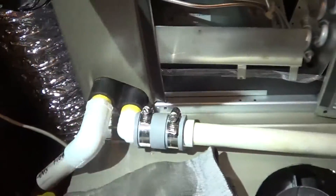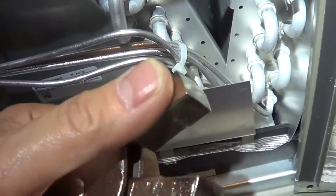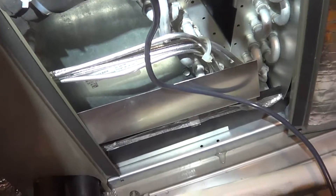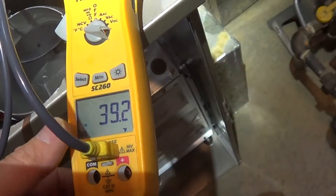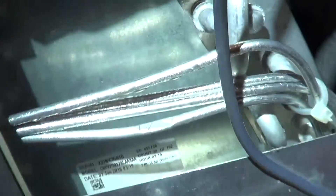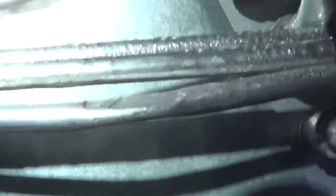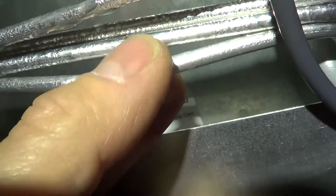I have a special tool here for this. As I'm pinching, I'm watching the temperature of that circuit. You can see it had to pinch down quite a bit. Looking at it from the side, I had to pinch it in the middle right there. And now we have balanced circuits.